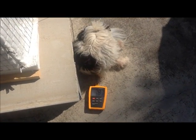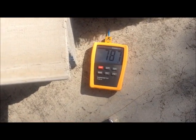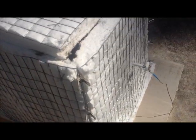My loyal little kiln helper Patches, my little 16-year-old dog, is supervising here. We're up to 787 degrees now. You can see my damper setting — I've just got it barely cracked, maybe 5 square inches total for the flue gases to escape. I have bumped up the flame a little bit, but it's starting to show a little blue in there while still mostly yellow. I haven't even hit second gear with this burner yet — I've got a lot more horsepower if I need it. It seems to be climbing at just about the rate that I want.